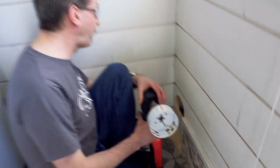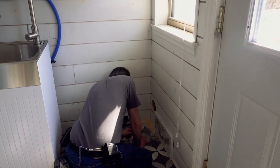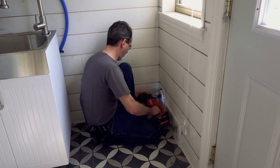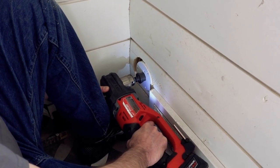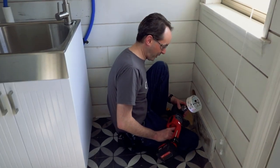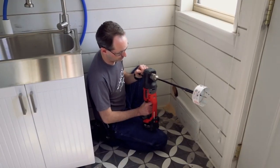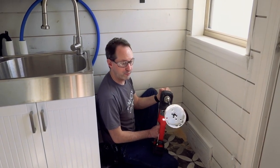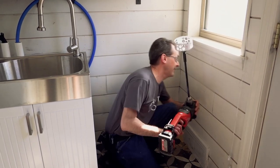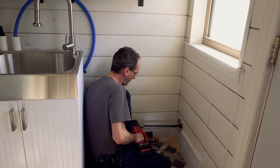There's a cripple stud here — it can't go higher than the window opening, so that's the stud we're dealing with. This is bad. Having a giant torquey drill on the end of a foot-and-a-half stick with a four-and-a-quarter inch hole saw unguided is not ideal. But it's gonna be fine. If I can fit this through, I can fit the pipe.